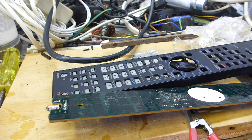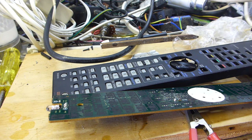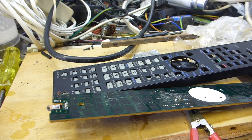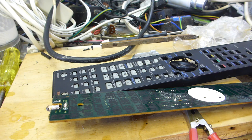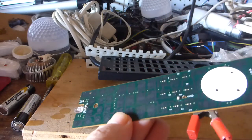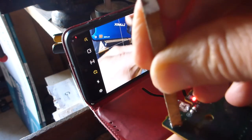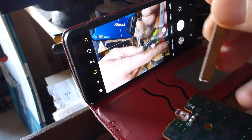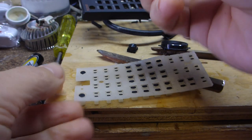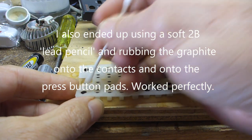Using a phone that doesn't have an infrared filter to see if I get a signal. What I'm trying to work out is whether the chip in the remote is busted or if it's just a problem with the contacts. If it's just the contacts I can get a carbon kit and change these pads out. I've powered up the remote again — if I connect the foil I can see it working. This proves the remote is okay but the carbon contacts on the back are stuffed.